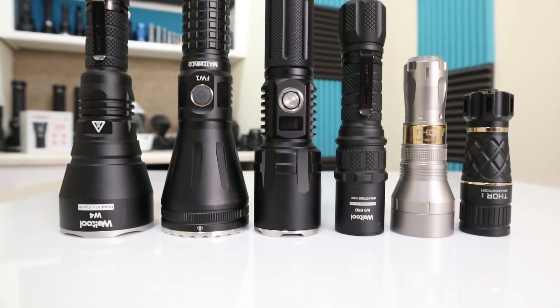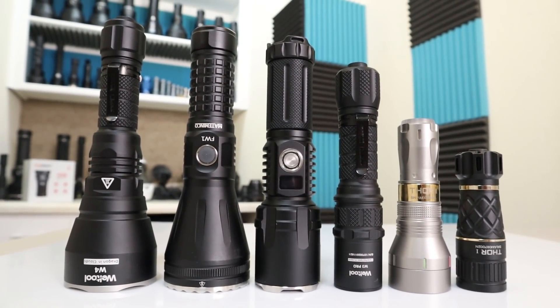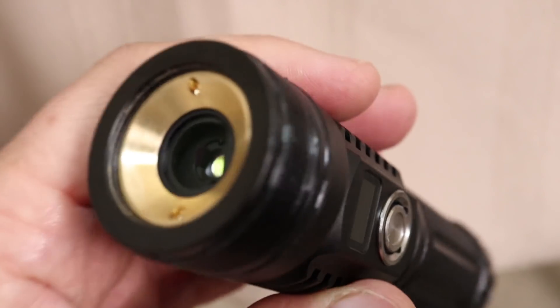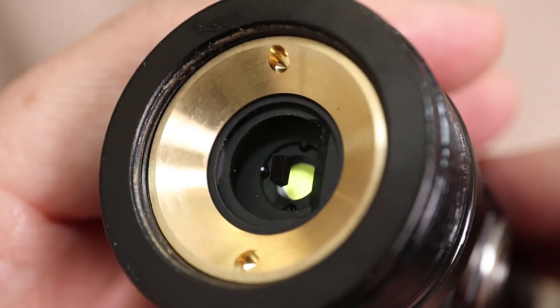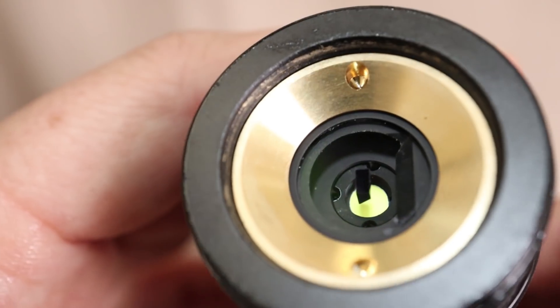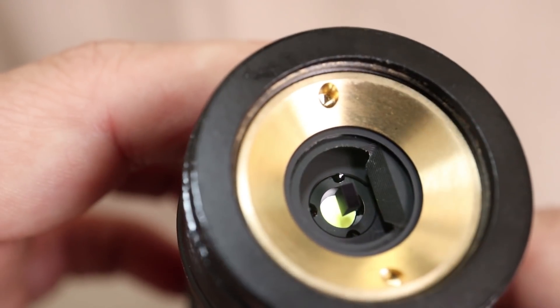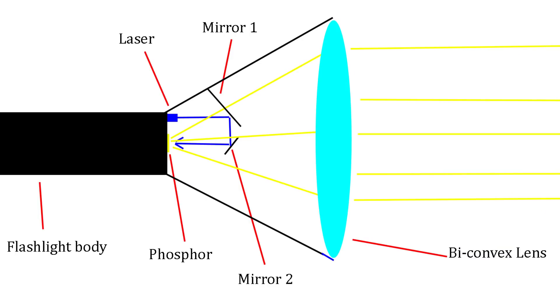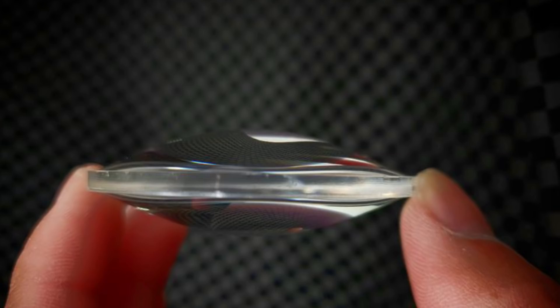Here's a size reference of our lights. The largest is powered by a USB-C rechargeable 21700 battery, down to our 18350 pocket-sized lights. All of these lights are LEP and not LED. LED is light-emitting diode, and LEP is laser-excited phosphor, which means they use an actual laser sitting off to one side in the flashlight body. The laser beam bounces off two mirrors — one off to the side, and one in the center that reflects the light downward into that yellowy phosphor, then bounces out the front through the bi-convex lens.